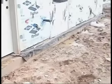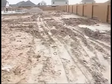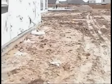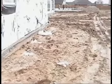Look at our backyard. The drainage isn't that good. Let's give the builder an opportunity to go through and correct the drainage, but we want to make a note to our client to make sure that this gets better grading before they move in. It's too flat. In its present state, it's not going to have proper drainage. It's something that needs to be corrected, certainly before any landscaping is done.